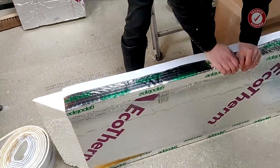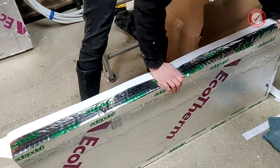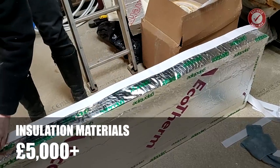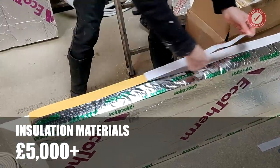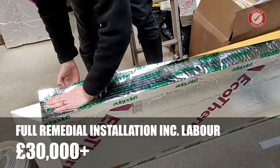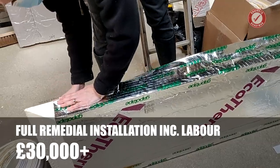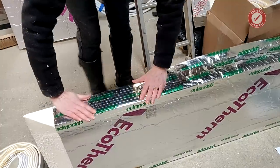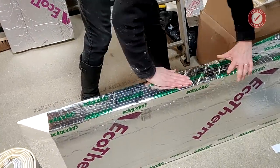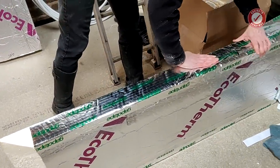We've fully sealed the final layer of insulation for added vapour control right up to the Velux windows in the kitchen, and we're installing 300 millimetres of insulation in the loft. We've reluctantly decided not to cut into our kitchen ceiling to fit spotlights — it took so long to insulate it properly, we just couldn't bring ourselves to degrade it, so we'll live with pendant lights instead. The materials alone for all of this were well over five grand, and to install all this insulation in an existing property you'd be lucky to get change from 30 grand. But in our view, this sort of work is essential before you even think about upgrading central heating systems.